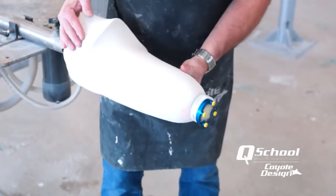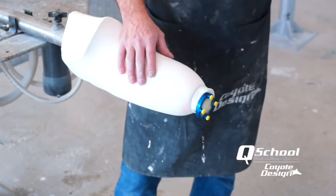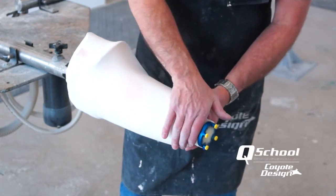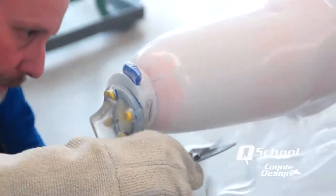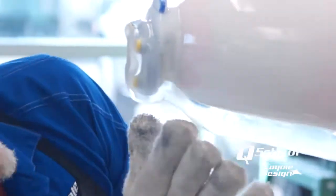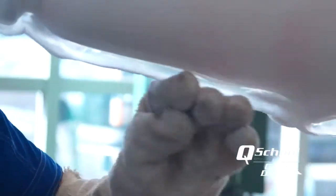I have a bit of an offset, so I want to bring my plastic around and seam it in that offset channel so I can help fill that up with plastic and make it stronger. The more your offset is, the more critical this is in your plastic pulling. You want to fill that in with that seam if you have the excess plastic, or take a chunk of plastic while it's still hot and fill that in — that will allow that plastic from doughing out or stress breaking when somebody walks on it. I'm just going to line it up from my deepest spot of my offset and run a straight seam down the back. We've got our plastic on, we've got good vacuum, everything's still hot.